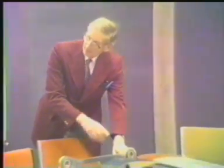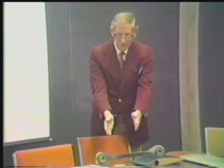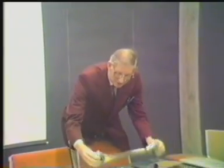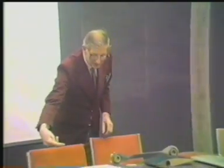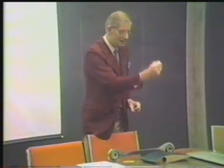So you'd have the flapping. This would be the hub here. So you'd have a pin here going right through. So the whole blade would flap up and down like this, and then the links would do this to give you the change in torsion, the pitch. And of course a little bit of this would go on as well. You couldn't have completely rigid links. So this hinge here, was that also giving flapping? No. Because you had a continuous shaft, the tube, all the way, or central spar.